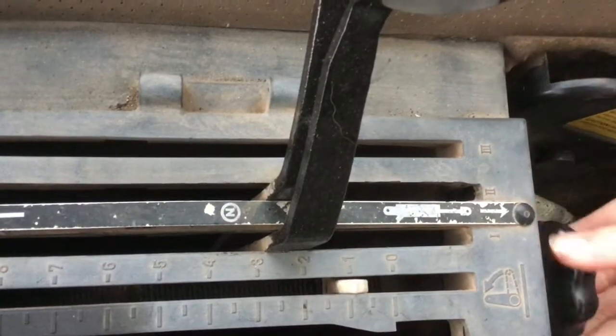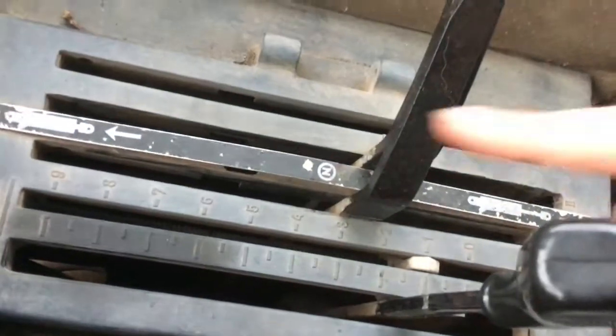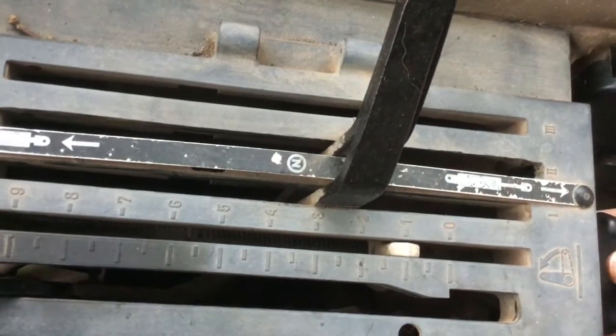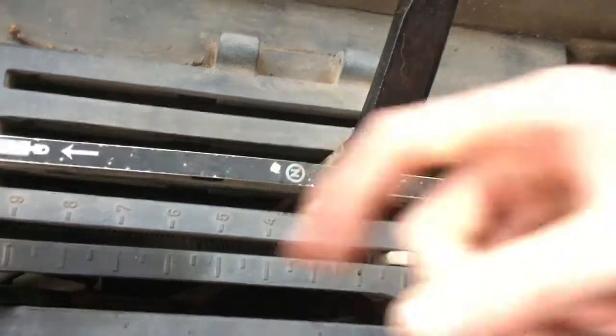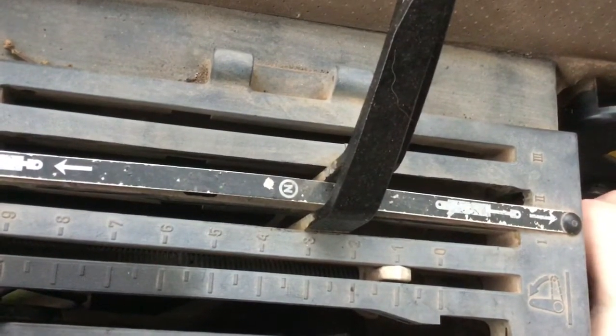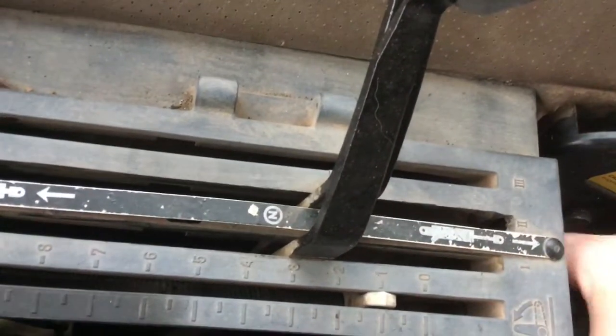As you can see, that's moving up there. So you can bring your links all the way back to there, and if you set that up when you're plowing, you can just simply pull the links down to that level and you won't have to change it all — you can just come right back down to that level. Pretty simple really.